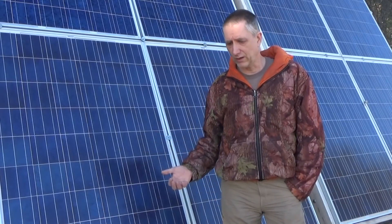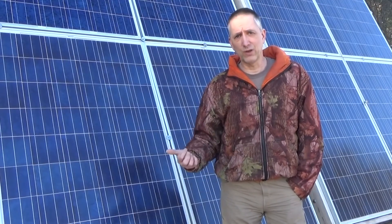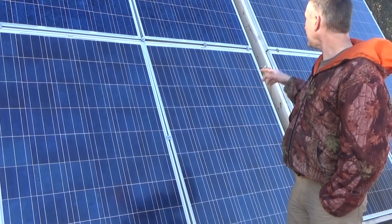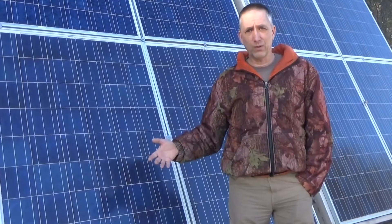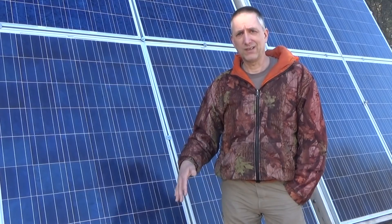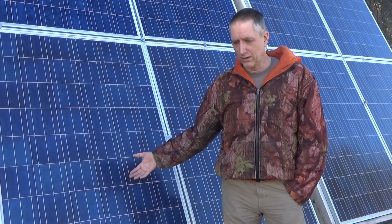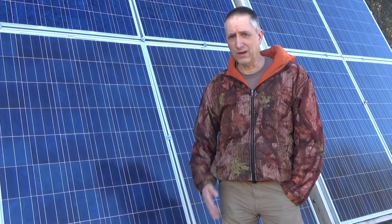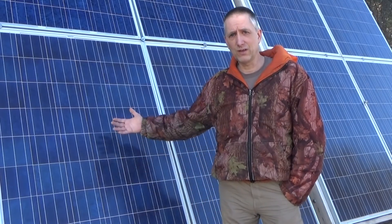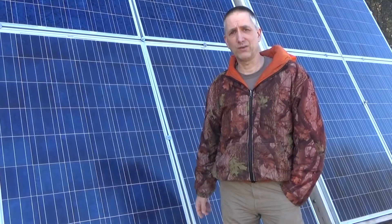Melanie could run the washing machine or vacuum cleaner, whatever she needed at the time if the power was full on. But with me not being home during the day because I'm working, I missed a beautiful sunny day. We had 1,600 watts of power today — every hour that's 1.6 kilowatt hours of power wasted because I didn't use it. I had nothing used in it at all. Batteries were in float and we had nothing running, so it was all gone. That energy can't be recovered. An average 10-hour day, that's 16 kilowatts of potential energy lost because I didn't dare turn anything on since I wasn't here to turn it off in case the sun didn't stay out all day.